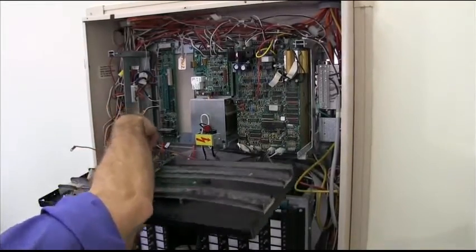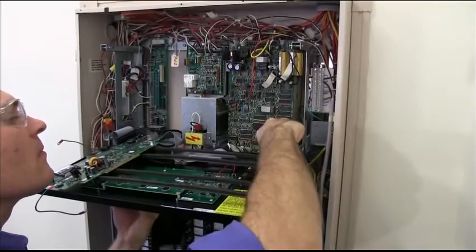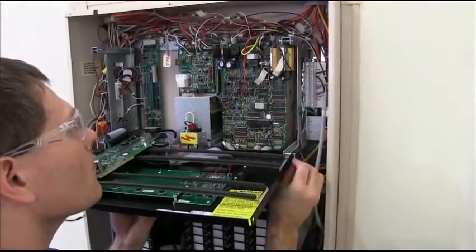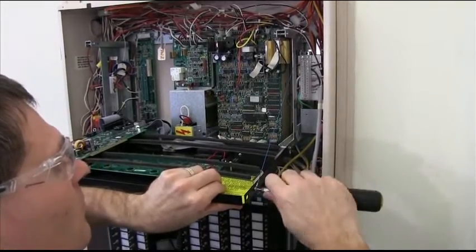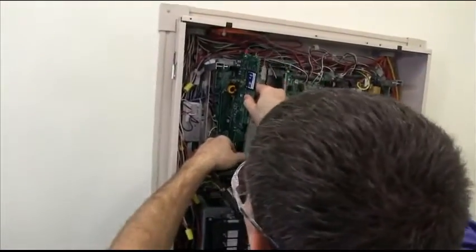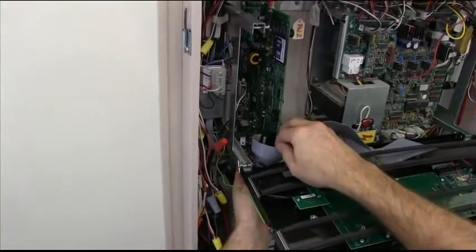You are now ready to install the 4100 ES upgrade kit. Install the 4100 ES upgrade display using the existing display pins and retaining wire. You have a simple and fast installation because the new display and CPU card replace the existing components without disrupting the remainder of the installation. The new CPU card plugs into the same card slot the old one was in. Plug in the new CPU card where the old one was, terminate the ground strap, connect the harness to the CPU card, and apply power to the panel.